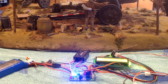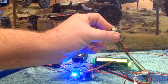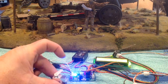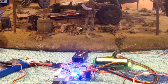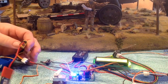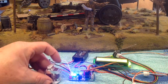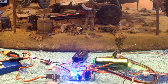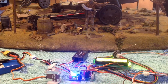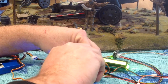So there we have it — just set up your Mako as an IR bunker, put in an IR emitter and receiver, and you can use a flash if you want. I haven't shown you how to set up the servo yet. As I said, you need to power it separately. I've connected it to my other power supply — so you connect just the power. If you look here, I've only connected to this servo the five-volt power and ground. The signal wire I've separated off — it comes out here — and you connect that to the servo port.